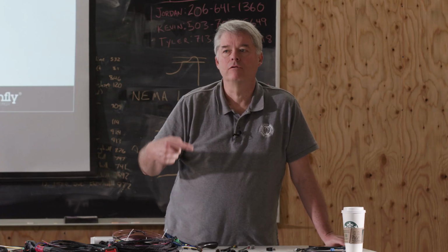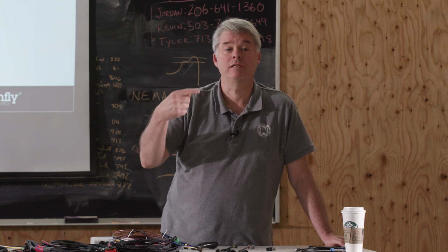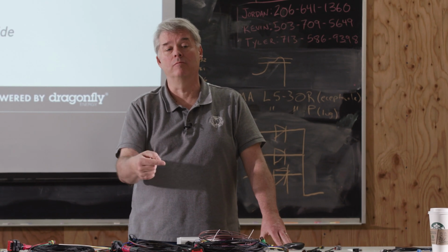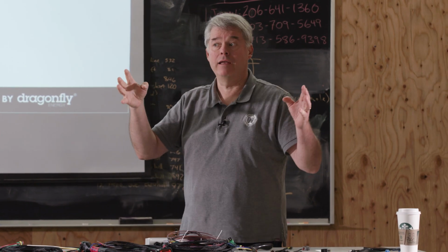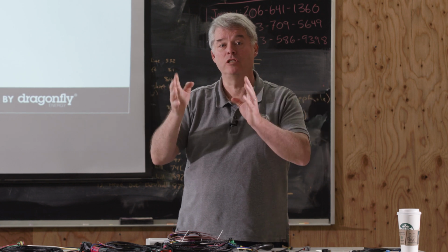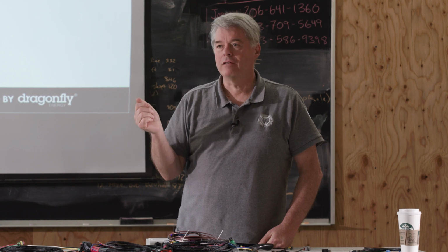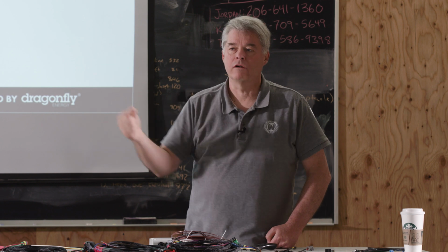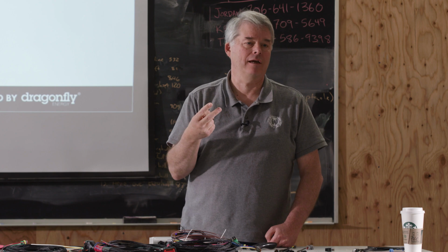We talked about messages of forewarning, of the BMS getting upset and saying, stop doing that. Of the BMS saying, you really better stop doing that or I'm going to call you home. And the BMS saying, I'm done, I'm out, and does a disconnect. That is all defined in the RVC spec. What's also defined in the RVC spec is this magic 2 seconds heads up. Before a BMS does a disconnect, it must send a CAN message that says, we are going to issue a disconnect command 2 seconds before it actually disconnects.